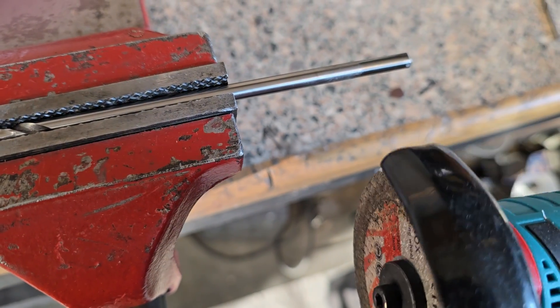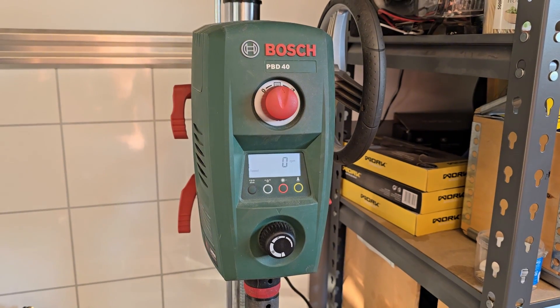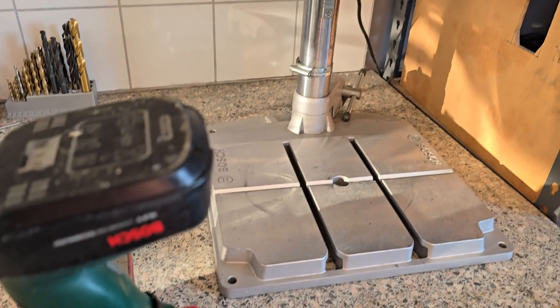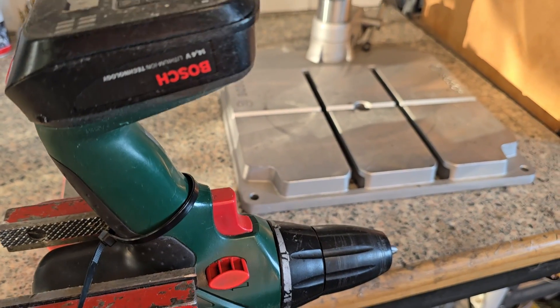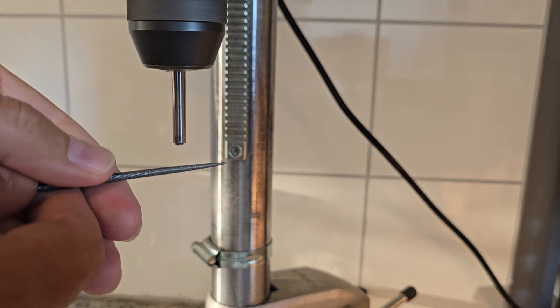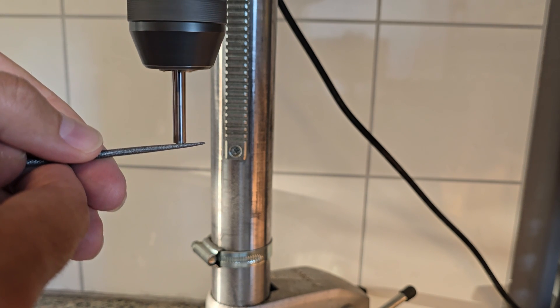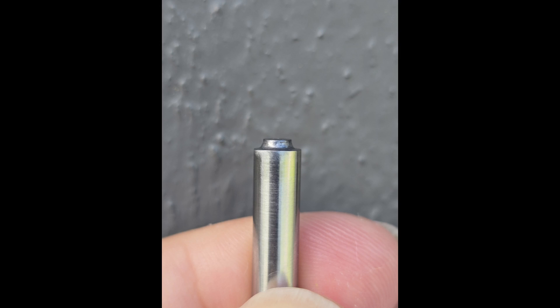Combined with one in 2mm for the hollow point itself. The fun part is that if you have a press drill or even a hand drill and a file, you can experiment with your own shapes of the tail if you don't want it to be flat. Here I'm spinning the drill bit for the punch at 1200rpm and cutting it slowly with a file to create a groove, which will in turn form a cup tail in the lead.